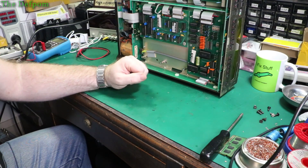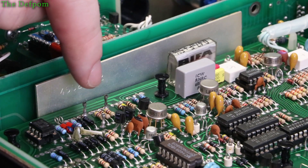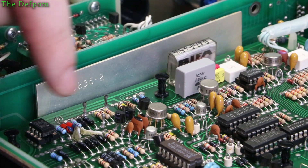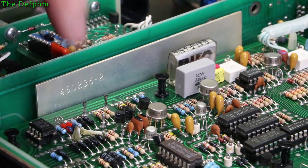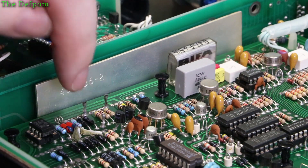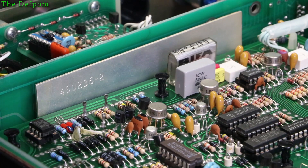It's going to need recapping and stuff like that, certainly. There are four posts here which are used for mounting something — I think resistors for tuning the voltage reference. My other unit's only got one resistor in the post across those; the other one is empty. That could be normal, it could be a problem — I don't actually know. I just want to bear in mind for this repair video that these posts aren't populated for some reason. It could be for tuning only; it may not matter. I'll have to look into it.